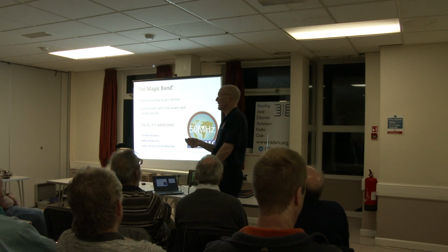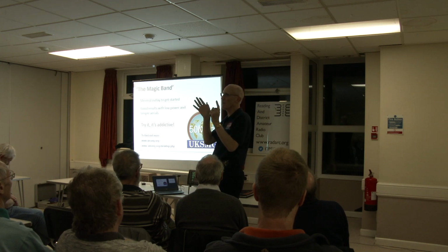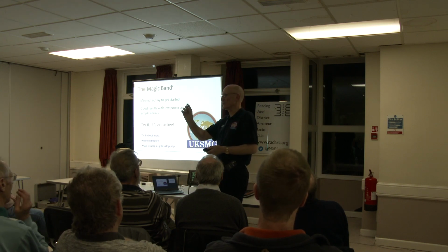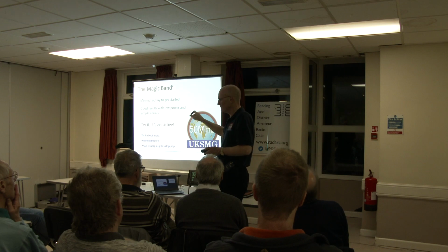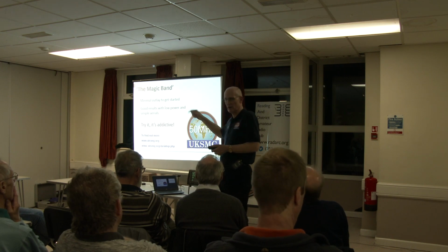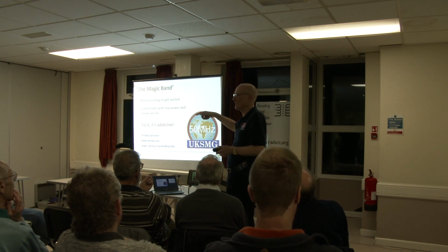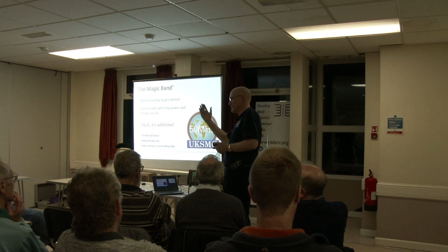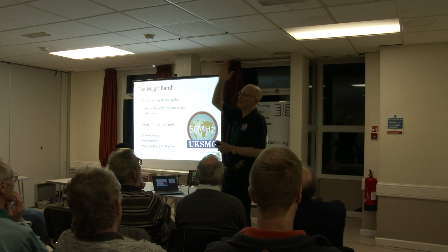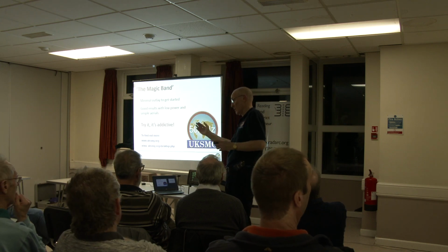One of the reasons people don't like the idea of moving the beacons above 50.4 is because of that exact reason, that it's 300 or 400 kilohertz higher up the band. And that's why we argued that we should retain a slot down the bottom for DX-oriented beacons, and that was the sort of origins of the synchronized beacon channel. It's only staggering into life, really. There's about 6 beacons now on that, and they all multi-hop, they hop between operating in the shared segment right at the bottom of the band, and they're at a frequency up in 50.4 as well. So they're on all the time, but they just hop between them.